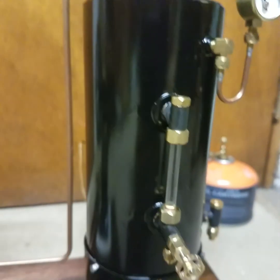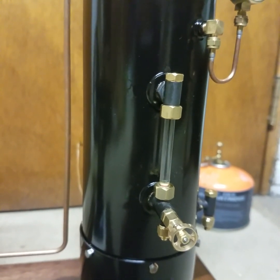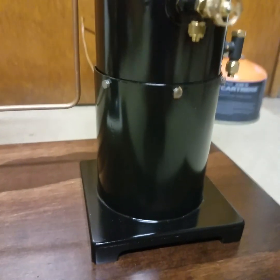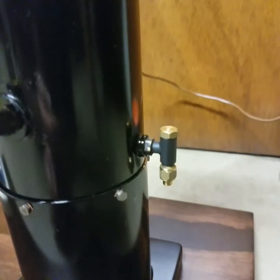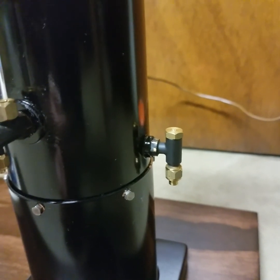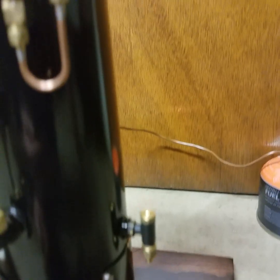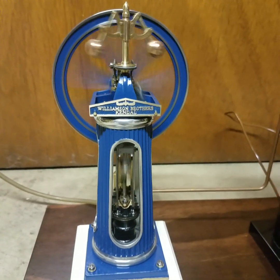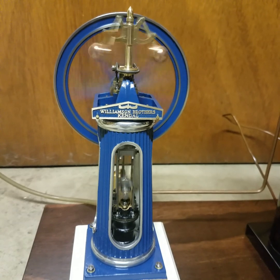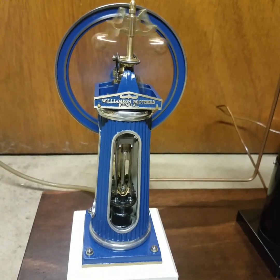This is a silver brazed boiler that held 60 psi on a hydraulic test with no problems — if it didn't, I wouldn't be running it right now. It has a check valve slash clack valve installed for possible future boiler refilling. She's just chugging away, running on live steam as it was intended.